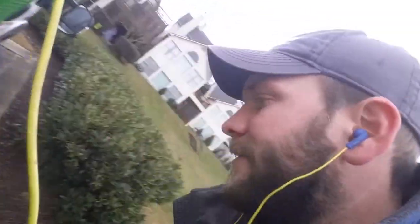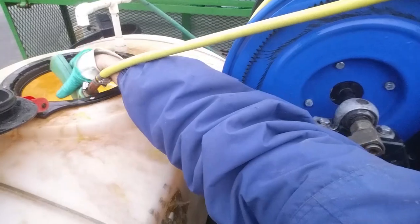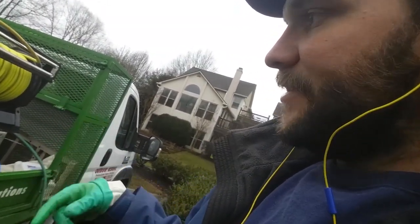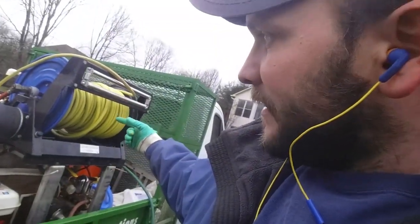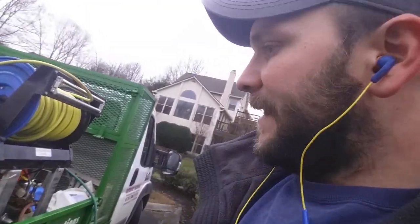So what I do now is I'll take my hose, lock my gun in the on position, and have that recycling back into the tank too. What that's going to do is mix my pre-emergent and my weed control through the agitation system, and slowly filter the mixed material into my hose so that when I start spraying on a yard, I've got the right material coming out at the right rate. So that's how I mix the tank.